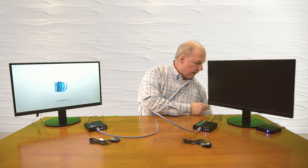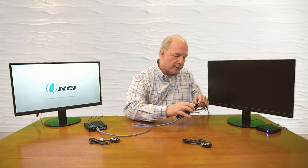And there you go — there's the actual display of that media content at the remote location. It does take a couple of seconds, but this is a product that supports full 4K ultra high definition content, so it takes a moment to make the adjustment to give you the best possible picture. Now one advantage of this product is the local loopback functionality, which allows you to continue enjoying the content here while simultaneously broadcasting to the remote location. To do that you'll connect another HDMI cable to the HDMI output port on the transmitter and the other end back to the monitor you were using initially. It'll take a second or two to adjust, and it brings the picture up here as well as downstream — you can enjoy the content at both locations simultaneously.